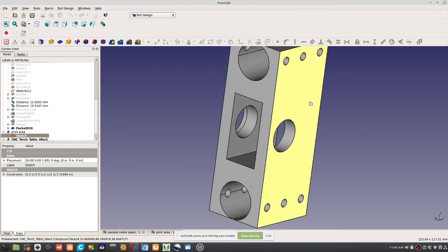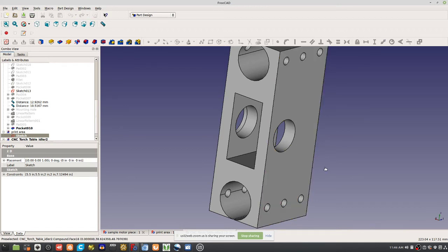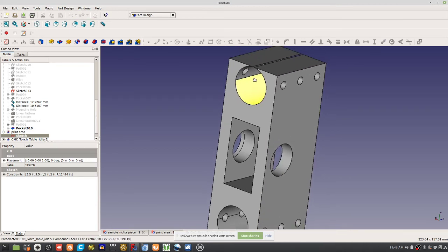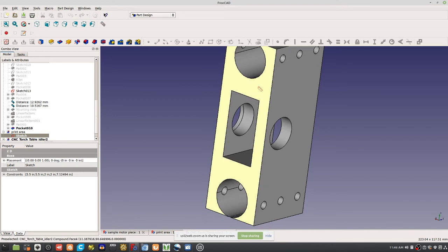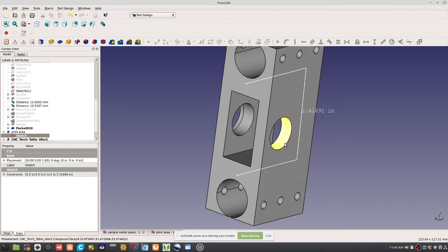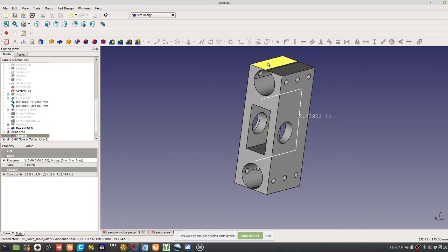Now we can also think, if that's a serious geometrical constraint, because if you want to attach in the most stable way, you'd ideally have a bolt hole up above this rod here. You can have one here too, and that would get you, say you had a bolt hole there and there. The separation there is about 2.5 inches, but that's in no way as stable as if the bolt holes were up here, so this thing wouldn't torque.